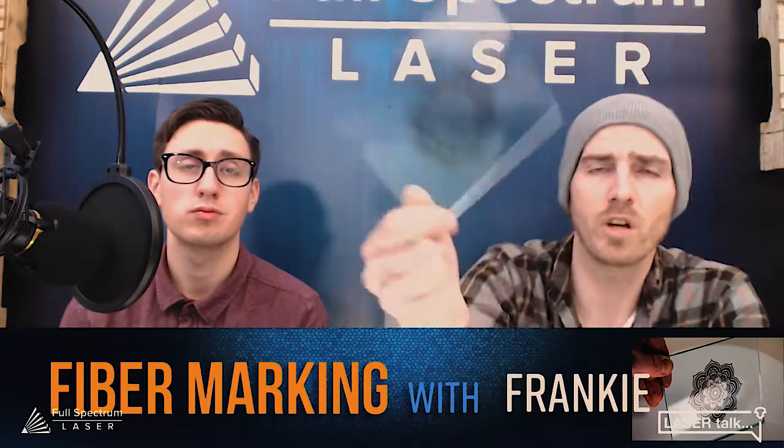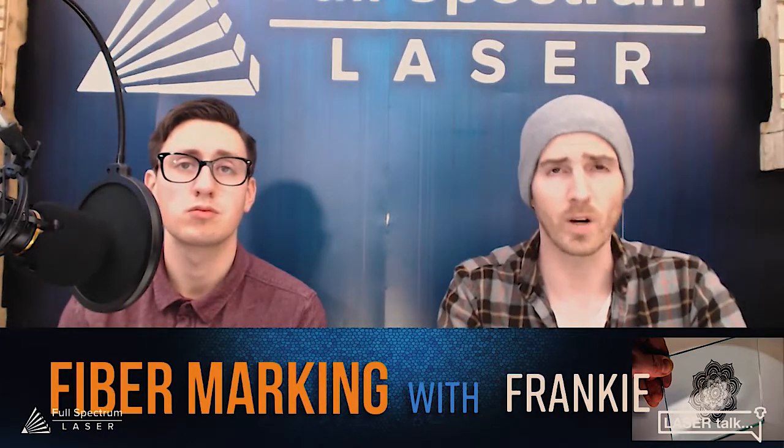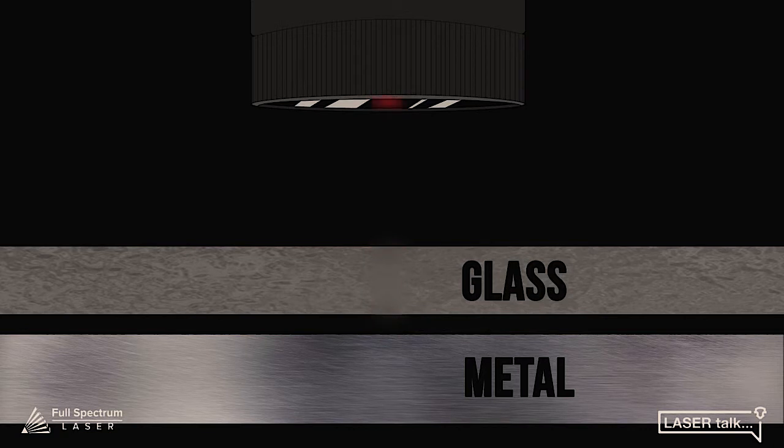Basically, Charles, if you want to roll the little graphic you created, what happens is the fiber laser, which normally doesn't mark glass, because the wavelength won't penetrate or affect the glass. What it'll do, though, is pass through the glass and touch the metal and actually bounce up, and the corrosion that happens from the stainless steel will actually be affected up on the glass. So what you're seeing on the glass example here is actually the result of the stainless steel being underneath the glass as it was marking.